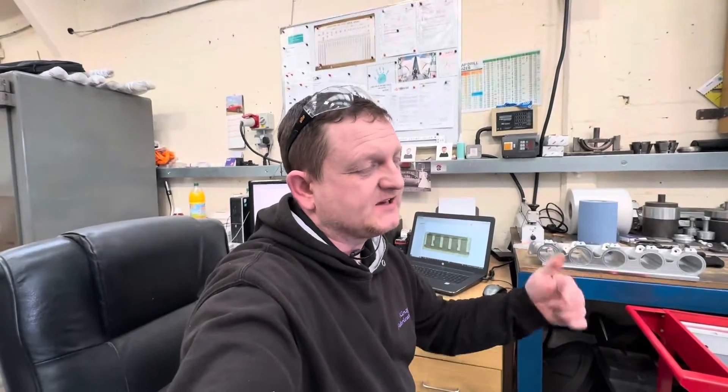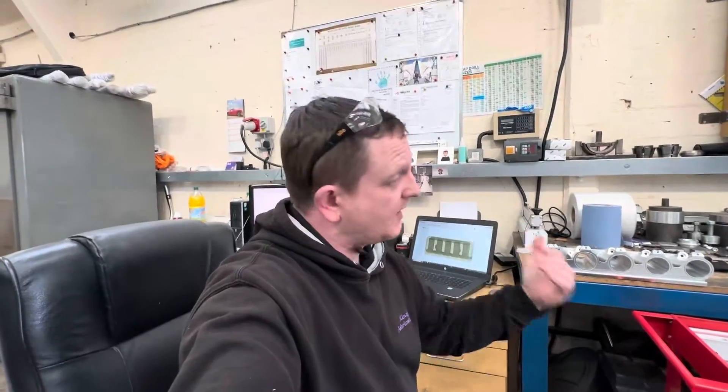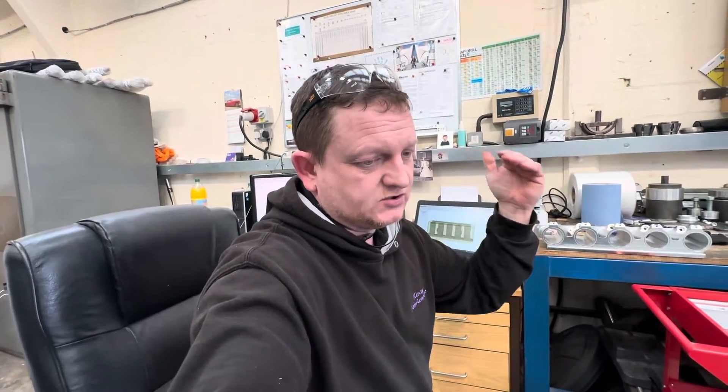Welcome to the video. You're going to see a couple of clips in a second. I actually forgot on the first clip to make it the start of the video, so you'll see me stoning the table for the fourth axis rotary and I didn't do any introduction, I'm just straight into what I'm doing. So this is just a quick intro. Still working on it, and as you guys suggested, I'm going to start from the very start point of making sure that the fourth axis rotary table is actually square in Y and square in Z. This is as good as I can get it, so I'll show you the clips.